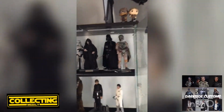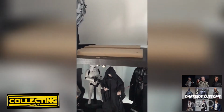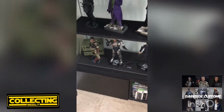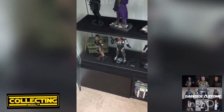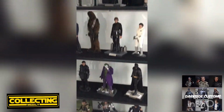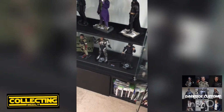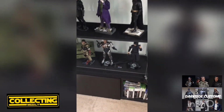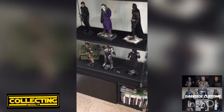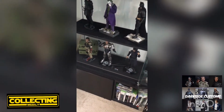So what I did was, if you look at the top, there is 2 pieces of 18mm ply that have just bridged the gap and screwed in place. And on the bottom, now the bottoms are a bit different. What I did do was I laid 18mm ply across the centre, and the plan was that once I'd lifted it up into place, I was going to unscrew that and then go up through the bottom and screw up into the units. I decided I quite liked the stepped look. I quite like that little ridge, so I thought I'll paint it black and I'll keep it. So the plan is I will be covering that in some sort of felt, but that will be way further down the line.